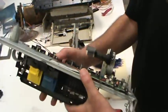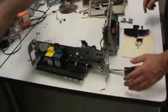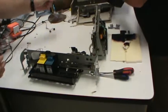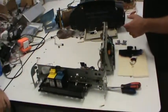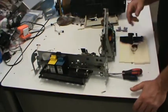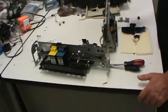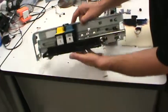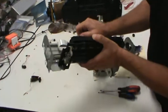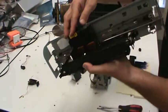How about a power supply on this thing? It turns out USB is the power — it was driven right off USB, so it's more efficient. Fortunately, we're not going to use these logic boards anyway — we don't need them. We'll hook up directly to the motors and control them that way. But we will have to hack into the photo sensors dealing with the quadrature encoder.